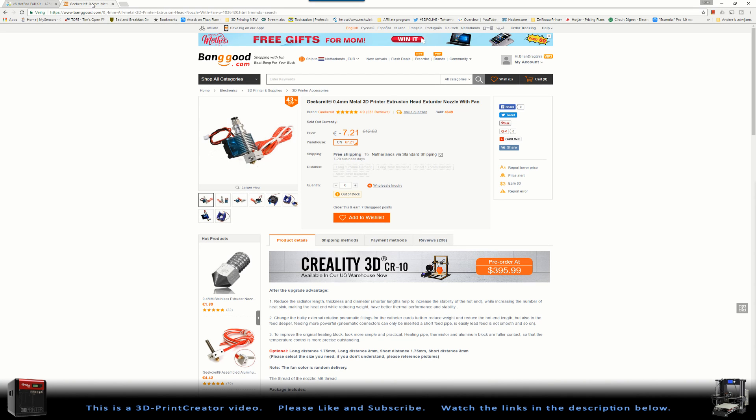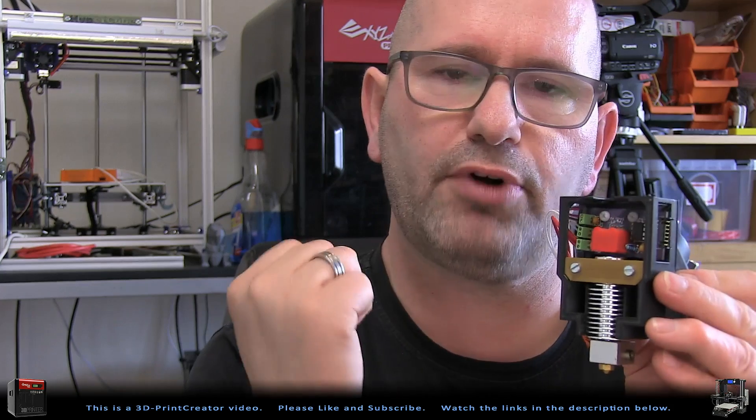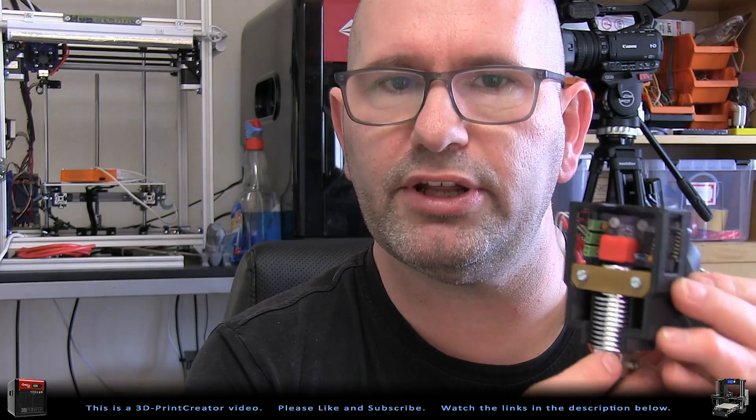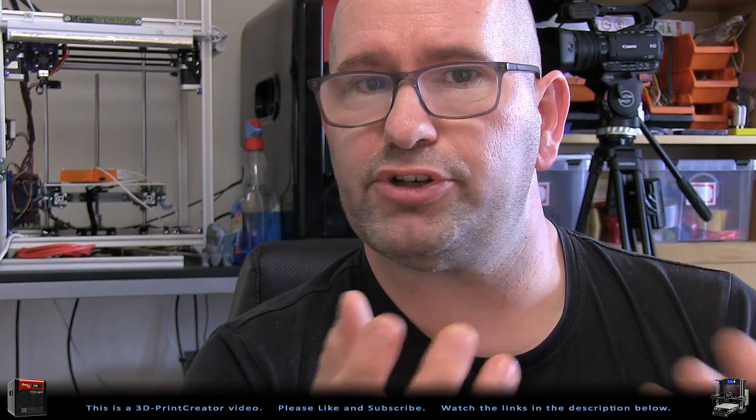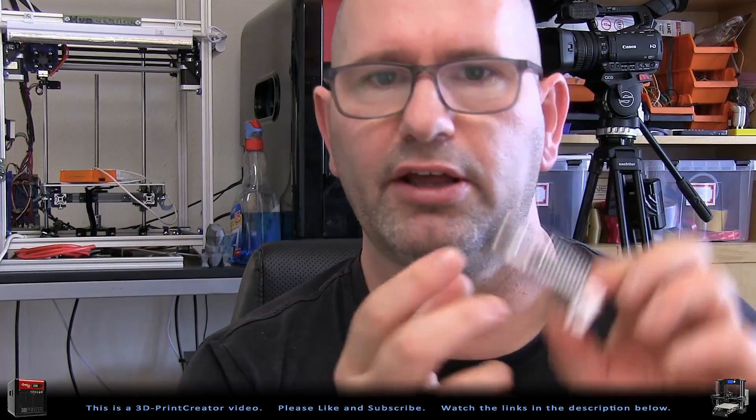Why should you choose between an original or a non-original version? What I've got here is a non-original, the very cheap one, and in a DaVinci Pro printer this works well too. The reason is that the DaVinci Pro printer can't heat up your nozzle to a higher temperature than 260 degrees Celsius, so there is no reason to go for the original that can go way higher. With the original you can go up to 300 degrees Celsius if you have one with an inner liner tube, or even 400 degrees Celsius with an all-metal version. For the DaVinci Pro machine you can't go that high, so there is reason enough to buy an El Cheapo version.